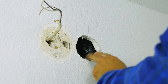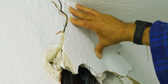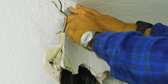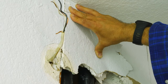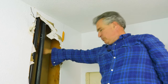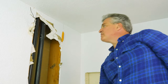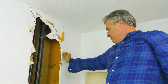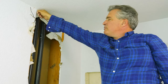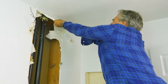There's a pipe back there. So we're going to have to cut the drywall away to see how much room we have to push the pipes back. We're going to score the drywall right in the middle of the stud. Then remove the drywall and push these pipes back against the wall so we can fit our electrical box correctly. I used my stud buddy to find the center of the stud, marked it straight down with the straight edge, scored it, and then pulled it off.